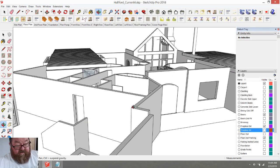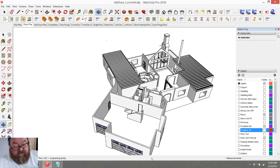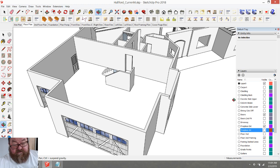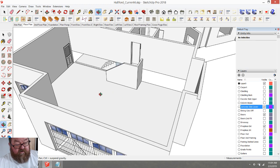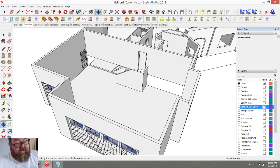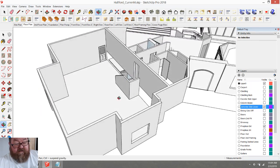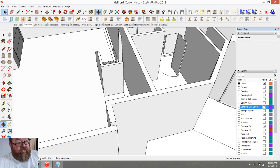The joists that I picked out for the garage are 16-inch deep, because of the concrete slab. Sorry about all the zooming. In SketchUp, if there's nothing where you're pointing when you're zooming, it zooms real fast. See, there's a floor anyway. So the span that I'm working with here is about 24.5 feet. So what I'm going to do is put a beam across here, an LVL, and I'm going to step these walls down 4 inches.